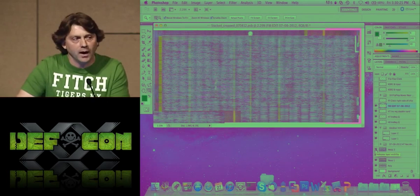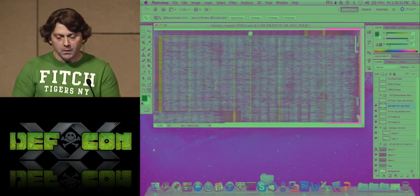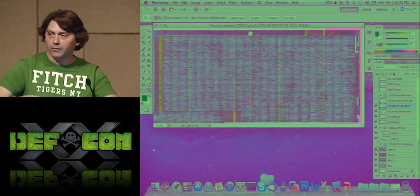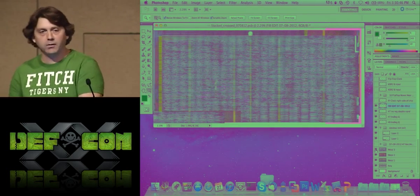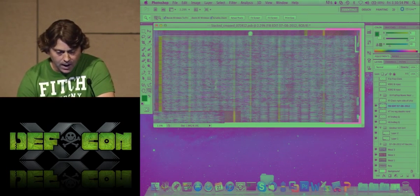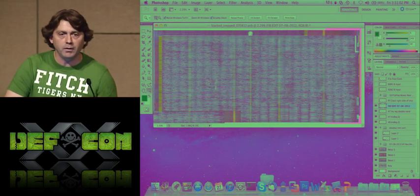I don't need to image the whole chip because you know that by design, there's no way that these guys would have the decrypted opcode, the instruction that they're about to execute in the middle of this nest of logic. And then where's it going to decode to? It's going to fan out all around in a 360? No, it's not. It's going to be somewhere towards the side, and then it'll fan out to the right, or it'll fan out to the left, or up or down. But it's not going to be in the center of this whole nest. I suppose it could be, but I've never seen one. I could show you Atmels and everything, Infineon, and the instruction registers are always somewhere near the edge.